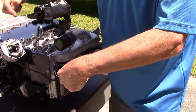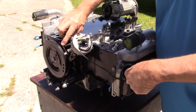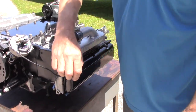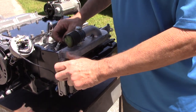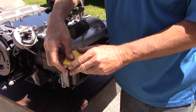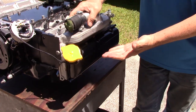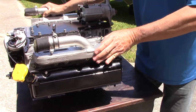You can touch the rocker right there and hold the propeller, rotate it around. If the mark on the balancer moves the rocker just when it's about 8 degrees before top dead center, the cam timing's correct. You can tell that without even taking a valve cover off. When doing a distributor setup, you don't need to pull the number one spark plug — you can tell what stroke it's on with your finger right there. These little details are all covered in great detail in the manuals.